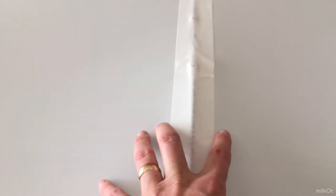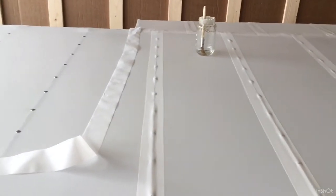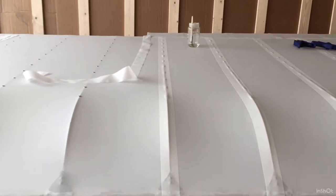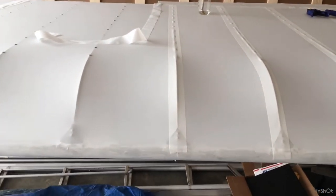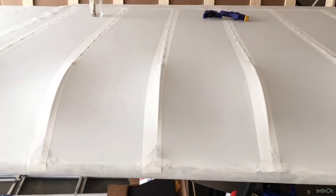Here's the trick with the seam tapes: if you try to straighten the tape as you go, it's not going to come out good. I'm going to have to re-glue that one — I tried to glue it multiple times and you can see it's kind of weird with a lot of glue on it. Contrast that with this one — just nice and straight; it's the last one I did. The trick is you've got to put a lot of glue on, glue the full width if not a little bit more than the tape, and put the tape on from the back first. The biggest tip: just pull the tape the way it wants to go. If you pull it straight, it'll stay straight, it actually creates a better seam, glues quicker, and has fewer bubbles.